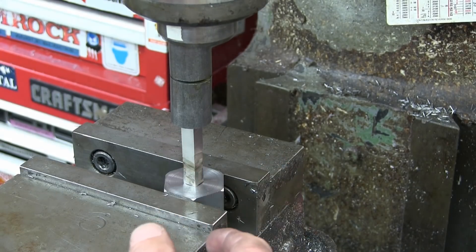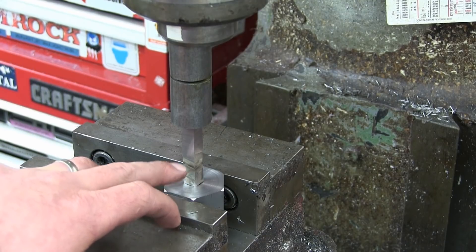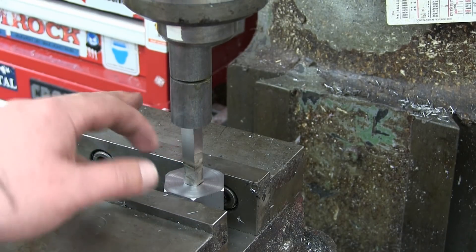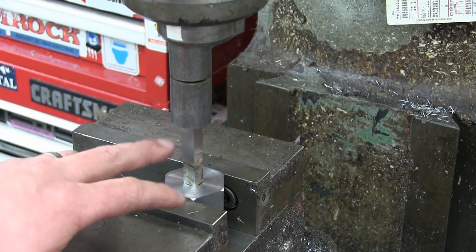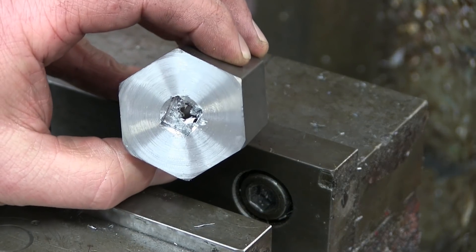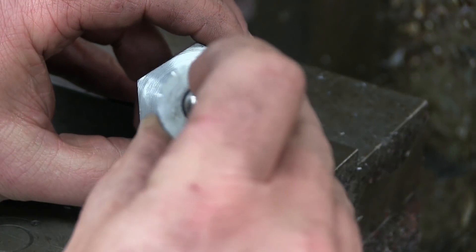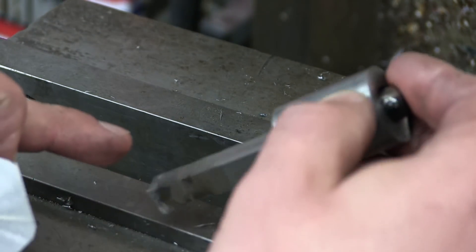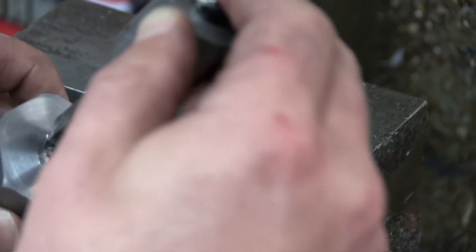If you're the sensitive type or even the sensible type, you're going to want to look away. Another note for the old Bridgeport — it's just like a D8 cat: it thrives on abuse and neglect. That's what I'm telling myself anyway. This is a broaching tool I made years ago and I showed it in a video. Back then it was just me and my mom watching. It's taking tiny little bites each time: we've got a conical grind here, a hemispherical grind here, and then we've ground some relief in here enough to allow a wobble in there. Each time around, it's just taking a tiny bite and moving a bit of material towards the center.